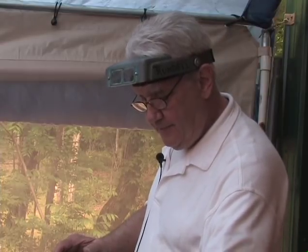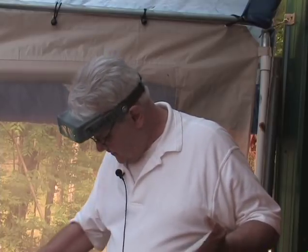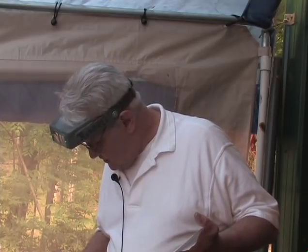There's one that the Italians use. The Italians take their chisel and they sharpen, they put the face on it, and then they put a long heel on it, like this. And that heel usually works out to be about 15 degrees. And so this whole area is cut down kind of like this. That's the way the Italians do it.